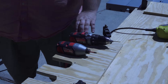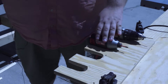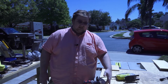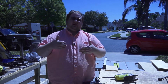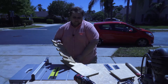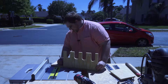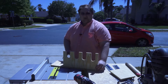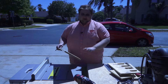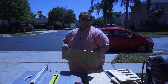We got all four notches cut out — this one's slightly bigger for my Ryobi drill. Now we're gonna put some walls on this and build it so we can mount it on the French cleat. We got the piece of scrap from before; we're gonna put it on the end, mark off to the edge, and chop it off on the chop saw. After that we'll rip it through the table saw to give about a four-inch height for the backing, then make some triangles for the sides to support it.